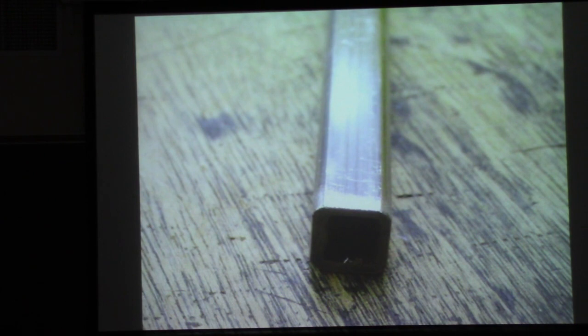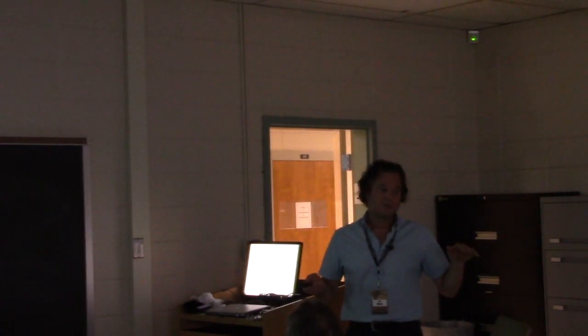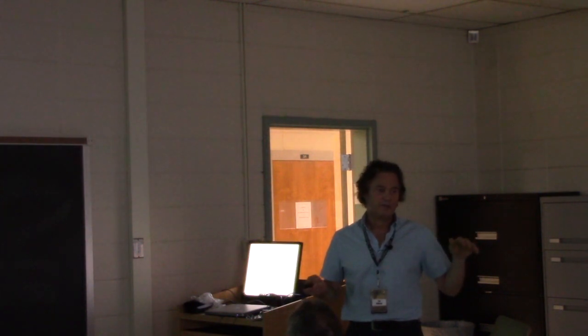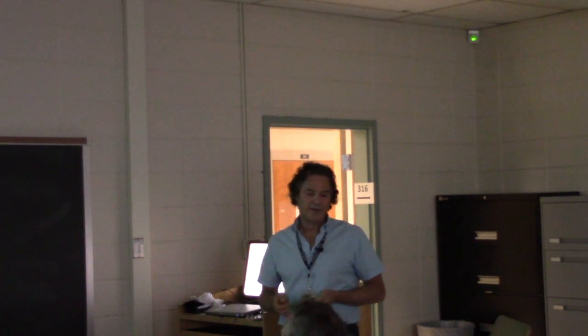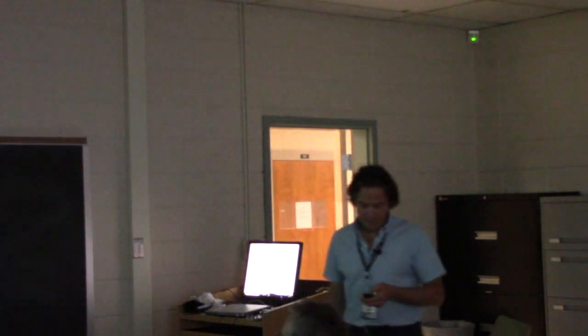These you replace because you find they're not strong enough? Yeah, exactly. And that's only on a situation where there's a huge hollow, maybe I'm talking 30 thousandths, under tension. In order to correct that, I correct forward bows by pulling out the frets, planing the fingerboard, and then refretting. Some people use heat to try and straighten it. I don't do that. So if I have a 30 plus bow, then I'm going to have to remove so much material that it's going to thin out the binding or the fingerboard. So depending on the budget, I might say, let's pull the neck off and the board off, put a new rod in there.